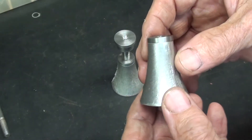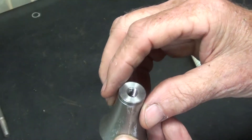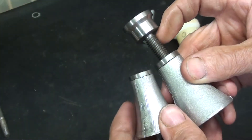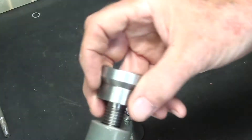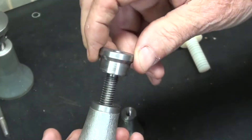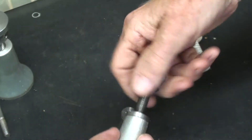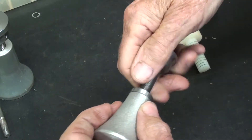It's another day and I'm going to finish this off. I did this much in the earlier part, and I'm going to go ahead and make the screw now — similar to this one, only slightly smaller. It will have a swivel. Remember, this one's just a dummy; it does not swivel, which makes it kind of useless. The one I'm going to make will be made out of seven-eighths round stock and I'll turn it down.